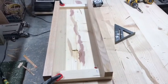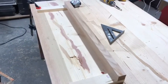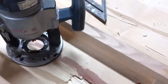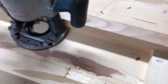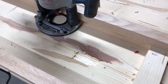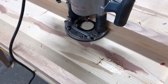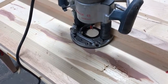I've made a jig, and as I told you before, woodworking is a lot about making jigs. This jig is so that I can put a router in and have a guide for my router — I just push it up against the edge of the wood and off I go. The idea is that I will route out a quarter inch deep all the way around, and when I'm done I will cut a piece of wood to fit into the cavity and glue it in.